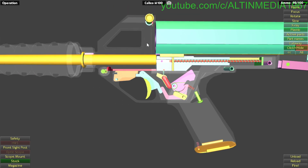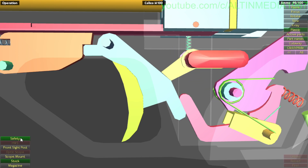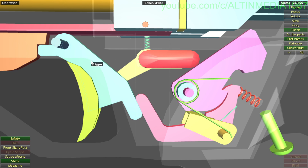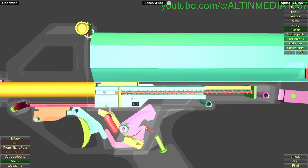So that's the mechanism — nothing really difficult about it; it's a 1980s design. Now the safety — I have a problem with it. The safety pin here holds the trigger. I would rather prefer that the safety pin holds the hammer. If it's done like this and something falls, an accident could happen — the sear could disengage the hammer and the round could be fired unexpectedly. I'd rather have the safety pin holding the hammer than the trigger. Okay, so that's the firing mechanism — let's remove the safety.